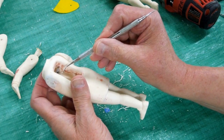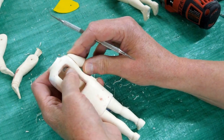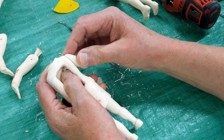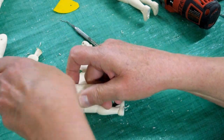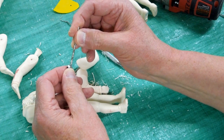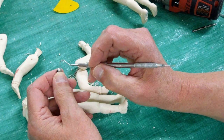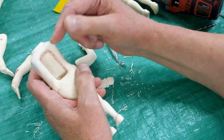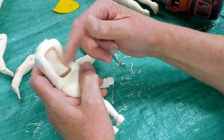In here, we're going to use a 3/32nd axle collar. That collar will be tightened, and that will adjust the free play on this arm, keeping it up against the body. I'm going to drill a suitable size hole in this. With the wire sticking in there, I'm going to silver solder that wire in there, and that wire sticking out will be my control rod for the arm. I'll do that for both arms and for the head.